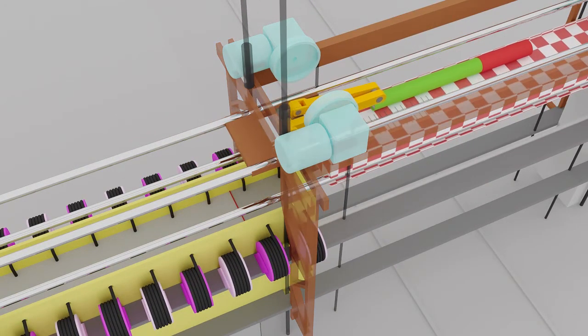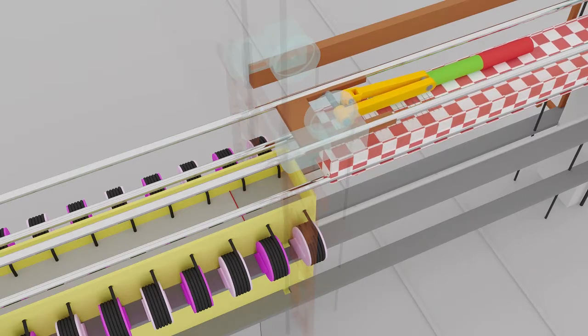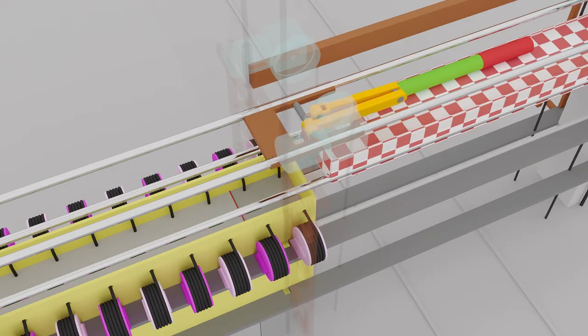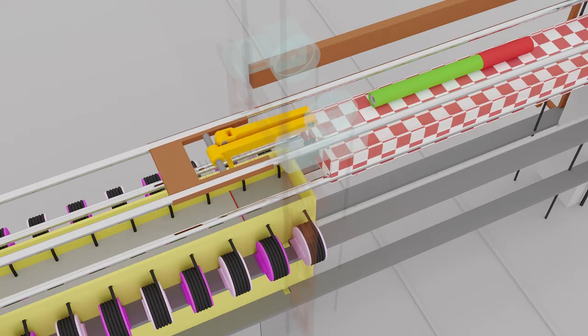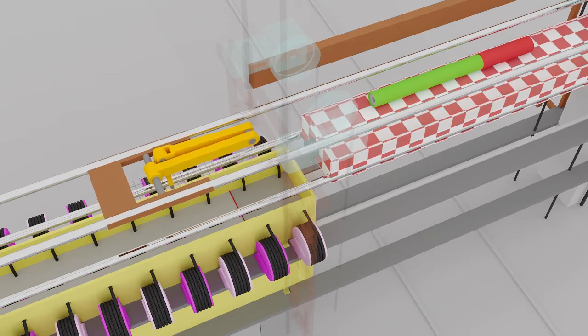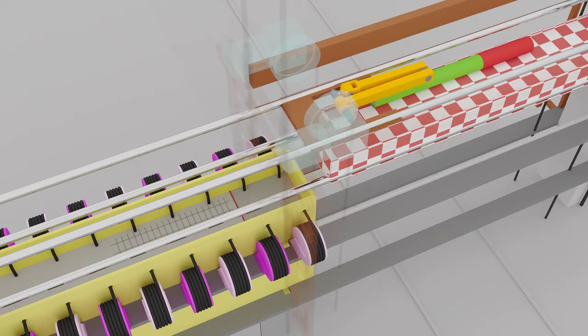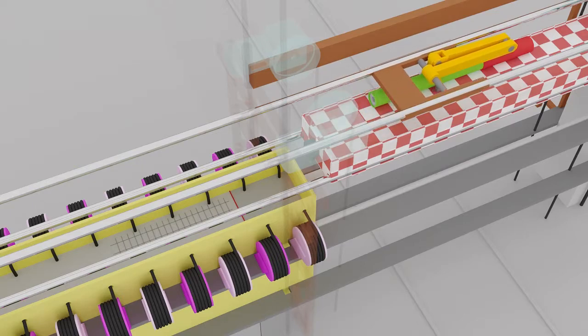The manipulator is fully automated and can take components from the cartridge cart and install them in the appropriate section of the concrete layer that is currently under construction. The manipulator has a set of rails that allow it to move in parallel to the concrete cartridge. It is equipped with a gripper, by means of which it can install various components into the concrete layer being poured, including cavity-forming plastic blocks, swivel hinges, reinforcements, and other embedded parts.